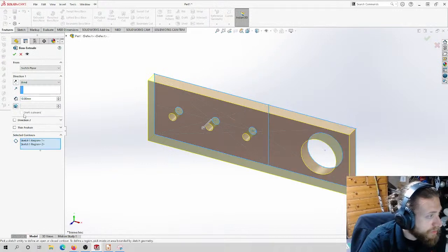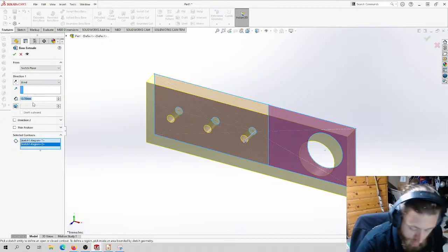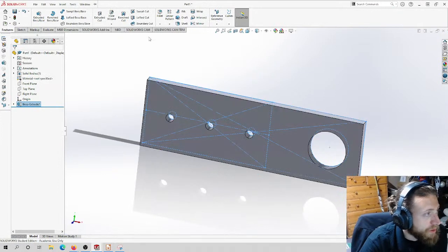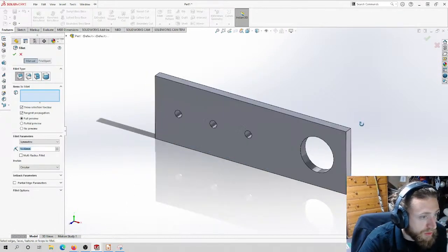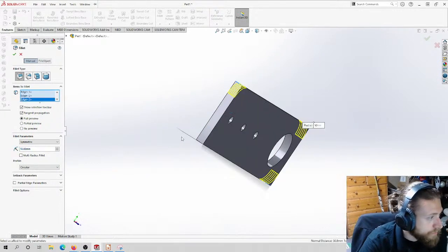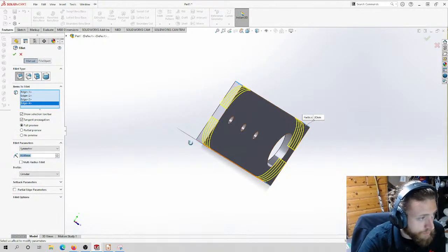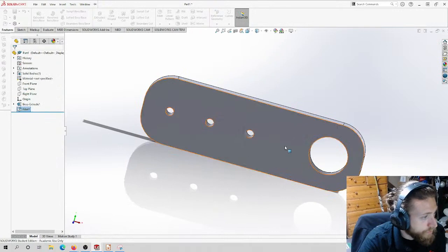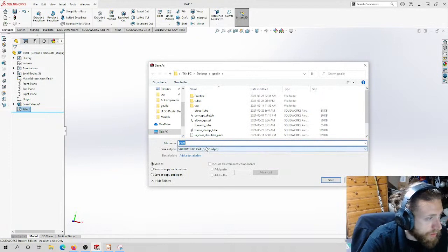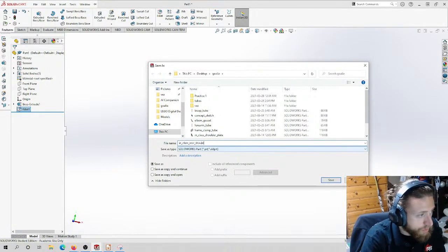Let's extrude into the third dimension. So 1, 2. And then 0.5 inch. Not 0.5, 0.25 inch. These are 1/4 inch plate. I'm going to round off the corners as well with a 20 millimeter fillet. And there we go. There's the other side of the arm. So we're going to call this the in-class rear shoulder.